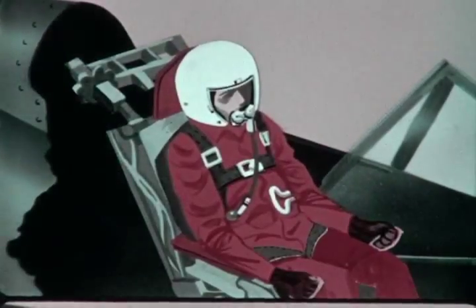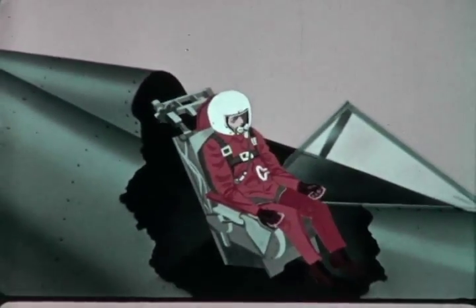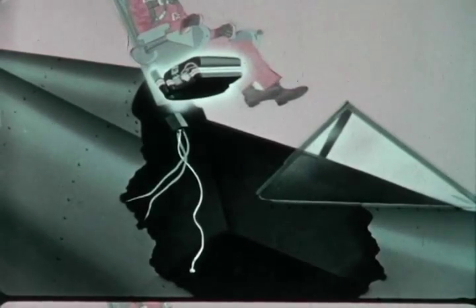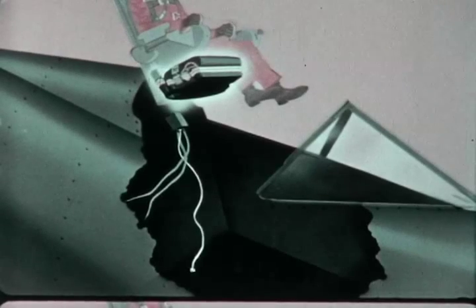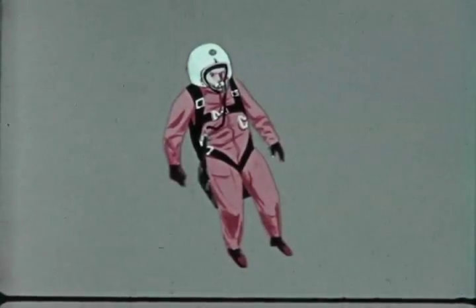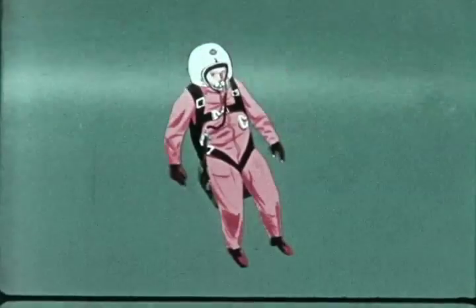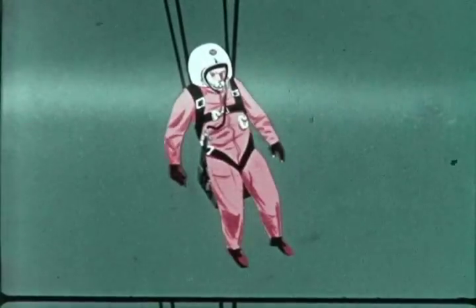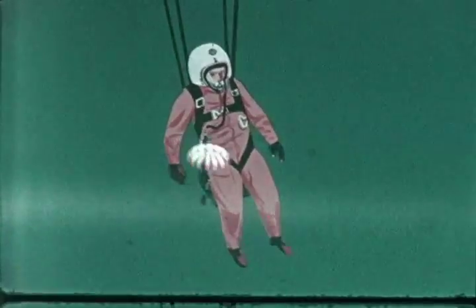In the event the pilot ejects, the lanyard attached to the ship-to-kit disconnect fitting automatically separates the connection between the survival kit and the aircraft, and at the same time activates his emergency oxygen supply. As we have already noted, the emergency oxygen supply from the global survival kit continues to supply the pilot with breathing oxygen and suit pressure while descending.